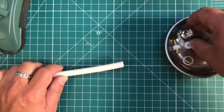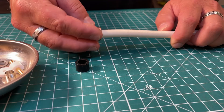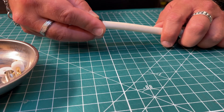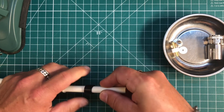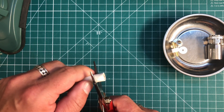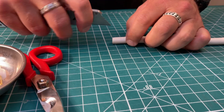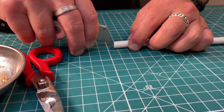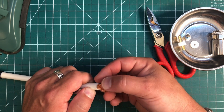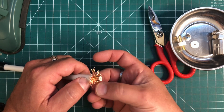The first thing we want to do is put some parts on the coax before anything else. We're going to start by sliding the end cap on, then put the washer over it, followed by the rubber gasket. Next we're going to strip approximately 10 millimeters of the jacket off. I like to score it with scissors and come back with a razor blade, slice in there, and it comes off nice and clean. Then we're going to spread apart the braided shield.